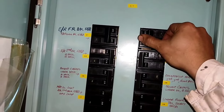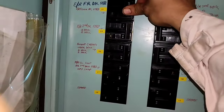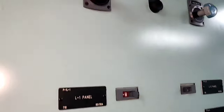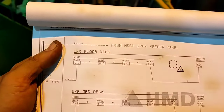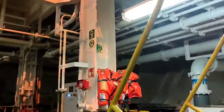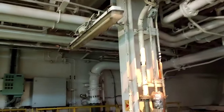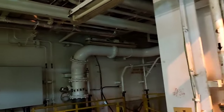As you can see, there is one breaker — lower deck. Lower deck is the problem. The remaining alarm is 1 Meg. For now, we need to resolve this low insulation first, but we still have a problem of almost 1 Meg low insulation.